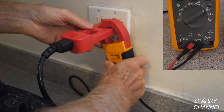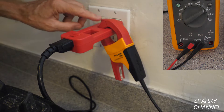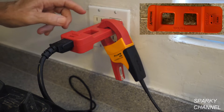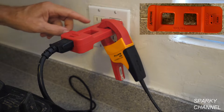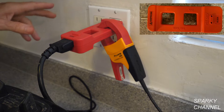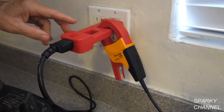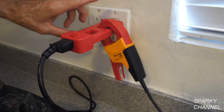You can put a clamp meter or a current clamp into one of the two slots of the AC line splitter. This is the x1 slot and this is the x10 slot. I have it in the x1 slot for simplicity for this video — the x10 slot will actually be more accurate, but the x1 slot will be just fine and will simplify things.